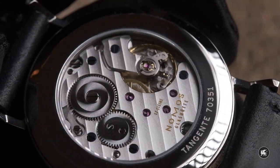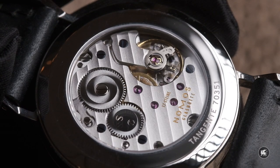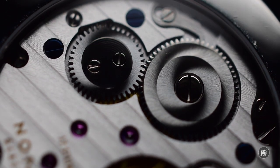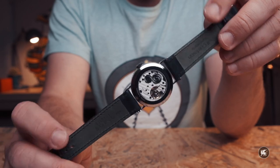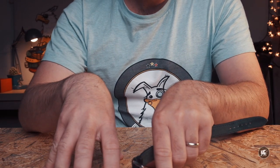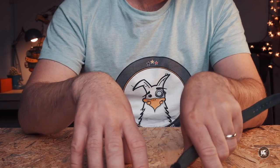The Glashütte ribbing plays very nicely with the light, the screws are polished blue steel and contrast very nicely on the rhodium-plated backdrop. There is more, look closely at the wheels and you will see the sunburst decoration reveal itself. The Alpha caliber does not currently feature NOMOS's swing system, perhaps in the future. It is a proven workhorse and also not expensive to service. Value for money and a great looking movement as well.